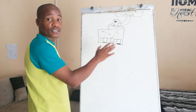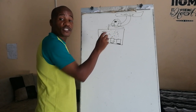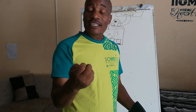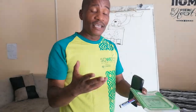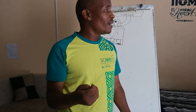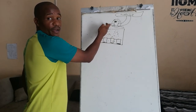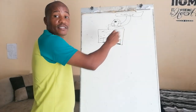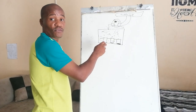That's its main operation. It has two main switches. The other one is at the lower position, connected to the flap. As the transformer gets overheated, more gas goes up. There's actually a gas which is lighter, so it climbs from the main tank into the main pipe. As it reaches there, more of it will actuate that flap, and then the mercury switch will operate, thus disconnecting the transformer.